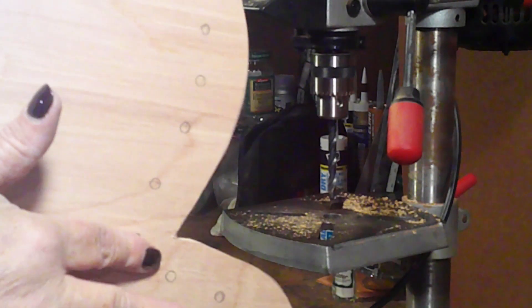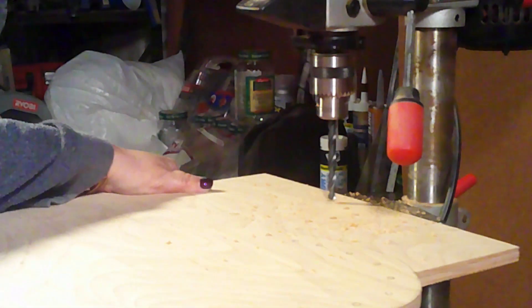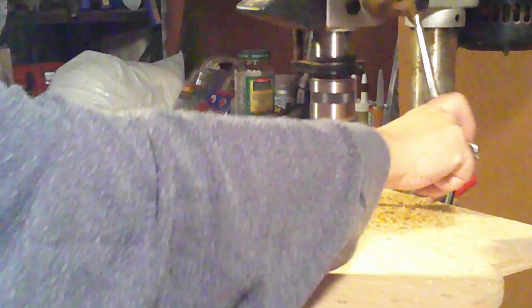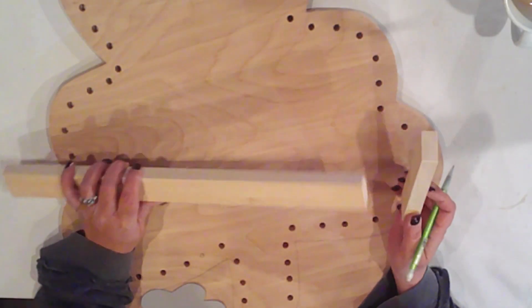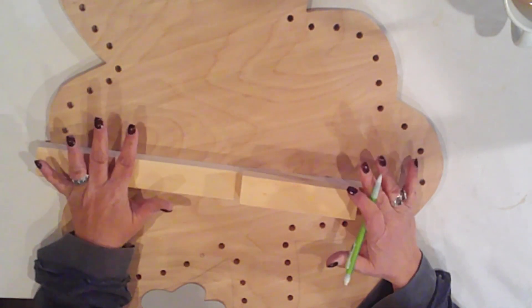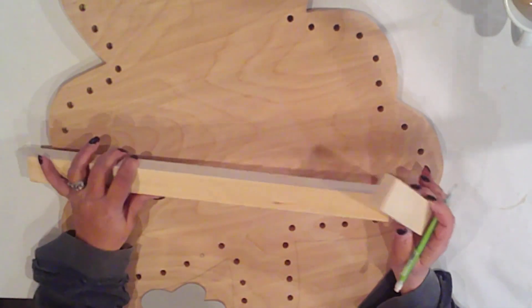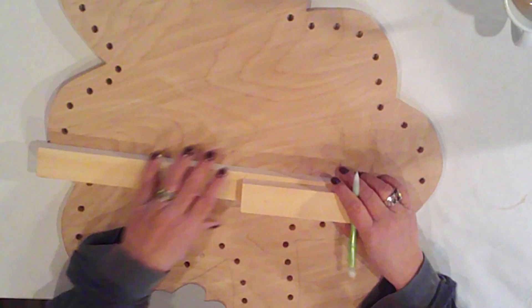Now I'll punch the light holes with my drill press. I line my holes up with the drill bit, turn on the press, and turn the crank until the bit passes completely through the wood. I'll move around my piece until each hole is punched. I also cut a 1x2 to 18 inches and one at 6 inches with my miter saw, but I didn't get that on camera — I didn't realize the camera had shut off. These pieces will make up my stand.